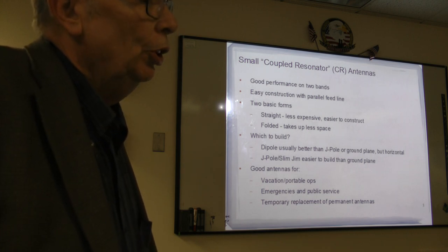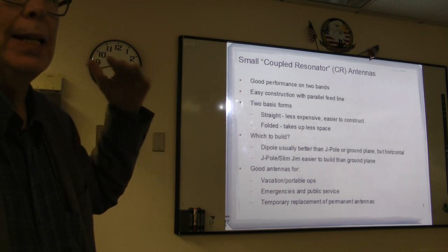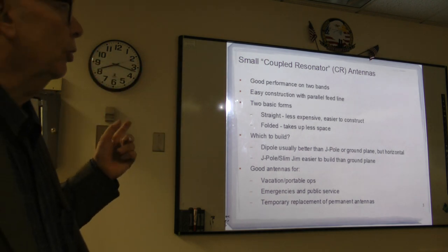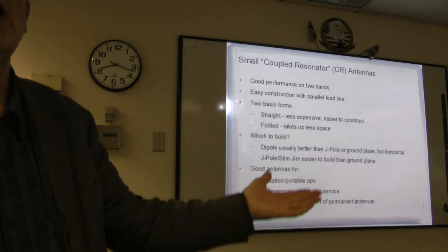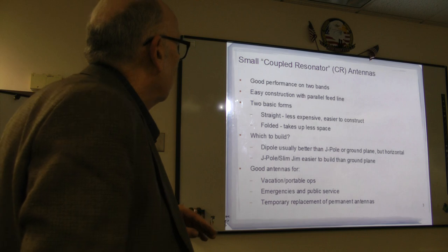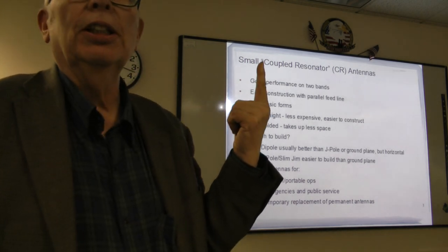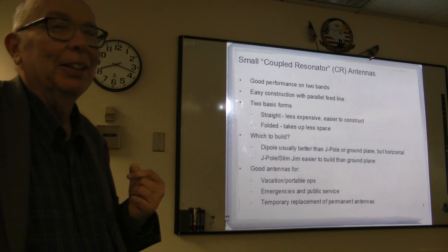The dipole: one of the things is you have to be very careful when you're talking about better on antennas, because exactly where you are and what you're trying to do determines which antenna is better. One of the factors is what polarization you want. If you're on 2 meters and you want to talk sideband, you want to be horizontally polarized anyhow. But there's an old saying about verticals: they are equally bad in all directions, unless you're living on a boat, in which case a vertical on the sound could be extremely effective.